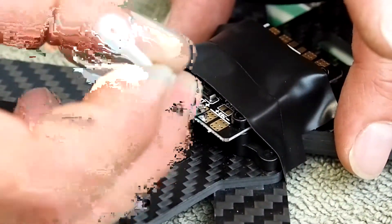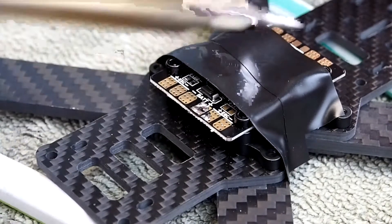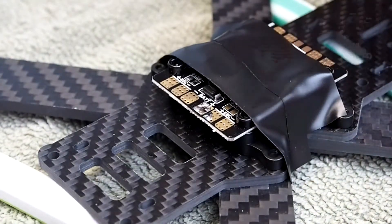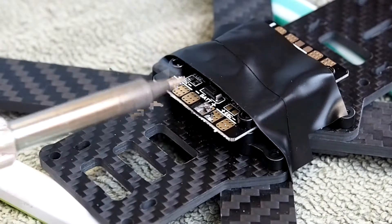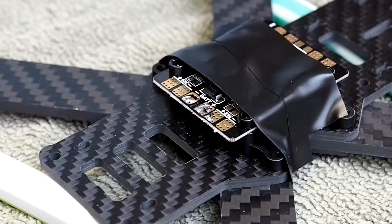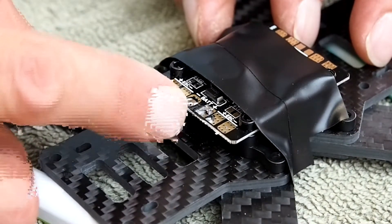So let's clean that off — I've got some alcohol, I'm going to clean off that pad. And we're going to tin that one. Nice and clean solder tip. I can't quite see how much wire I've got sticking out of it — not much, that's all I'm going to use. Let's tin the tip: good amount of solder on the tip, at an angle, press against the pad, bring in some solder — plenty — lift straight up. That's good right there. I like that.